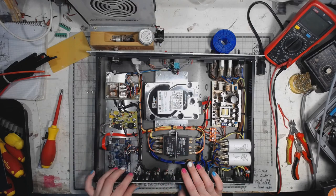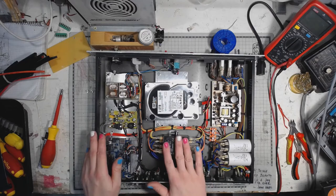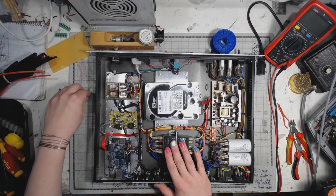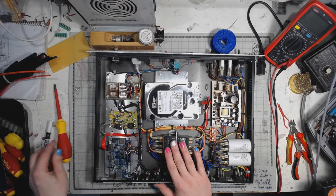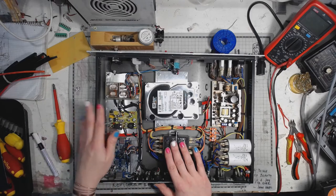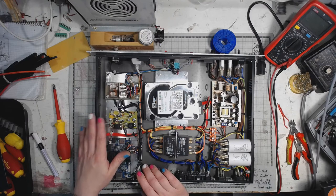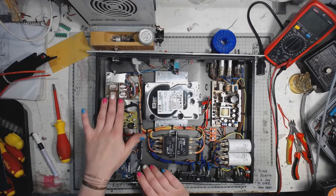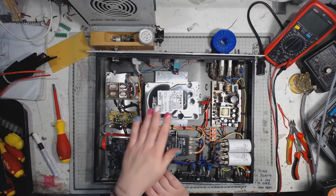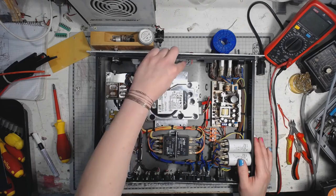And what does this board do? First of all, it controls the relays. It controls the power to the hi-fi system, and I can send it a command through the web interface over HTTP. Second, it is an audio interface, using a Behringer UCA 222 interface and the balanced line transformers, and it acts as a network attached storage for my music files.